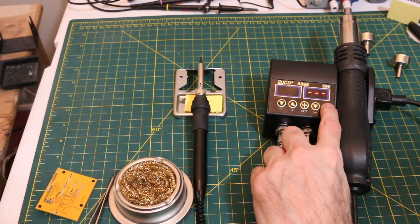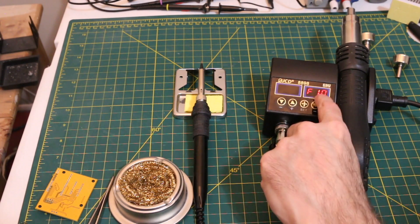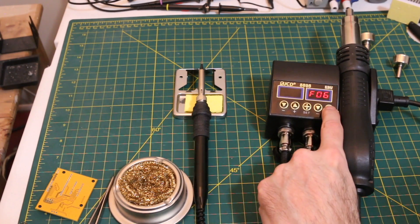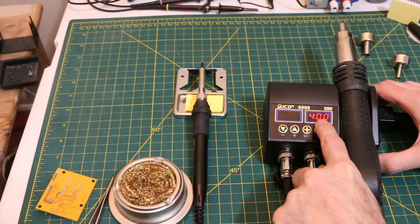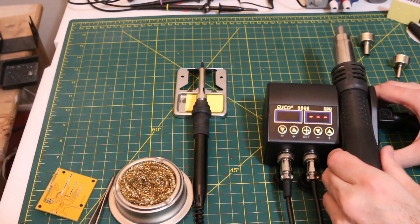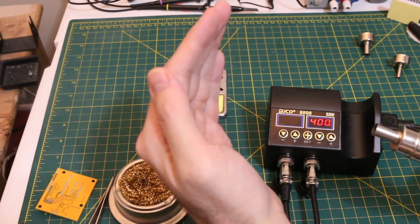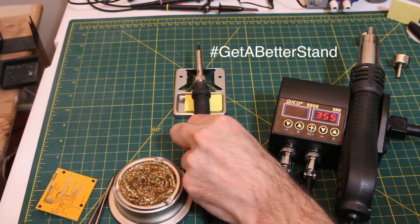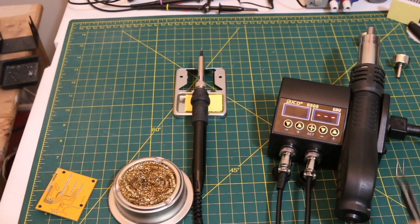Turning on the hot air, it starts at around 100 degrees. I'll bring it up to 400. There's a fan button — right now it's at 10, which is the highest, and it looks like it goes between 5 and 10. While it's in the stand, the magnet keeps it switched off. Set to 400 with the fan on full, when I lift it, it should kick in — and there it goes, heating up through 200, then 300. It's already got hot air coming out. Placing it back down, it's cooling down, and it will continue purging until it's safe enough, then shut off completely. Now it's at 100 and it finally shut off.